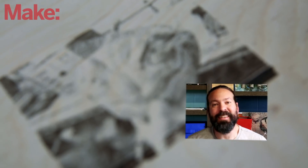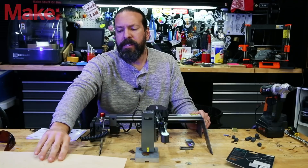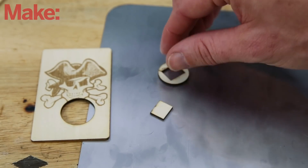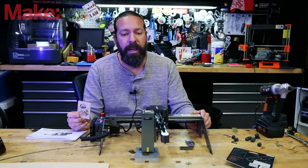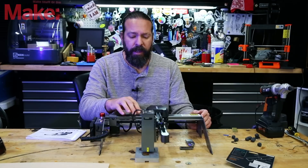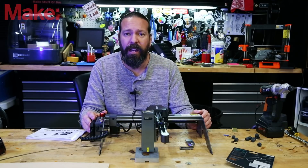Be sure to subscribe to the newsletter and get weekly deals. I was able to run this laser to engrave wood with no problem — I got fantastic results. It's also capable of cutting materials. It cut this little card here — I cut a circle on a square, it cut perfectly fine. It took three passes to do this beautiful cut, though I could have increased the power to do it in one pass with more of a scorched edge. I did three passes at lower strength, and I'm impressed with how pretty of a cut this actually did. With diode lasers, you just need to weigh the pros and cons and the trade-offs. They're cheaper and easier to move, but they're weaker. Your CO2 laser is going to be more suited to cutting thicker materials faster, but these little diode lasers seem to be doing the job just fine for some basic cutting and engraving.